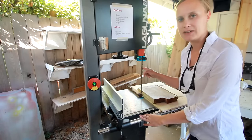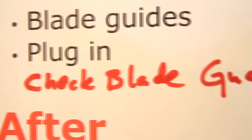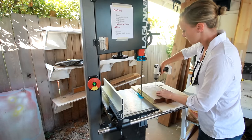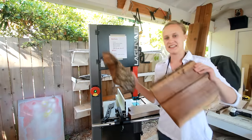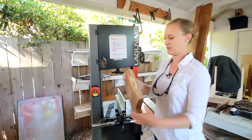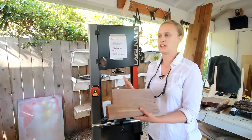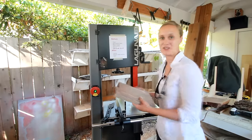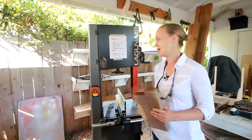You might have noticed I did not have my blade guard down — that's because it wasn't on the list. Now I'm going to unscrew this and do a cut next to the fence. You can see that I've taken these pieces off from the log and turned it into a beautiful milled-up piece of walnut. To finish squaring up these edges, I'd do that cut either on the miter saw or with a cross-cut jig on the table saw — or you could make a cross-cut jig for the bandsaw, which I might do in the future.